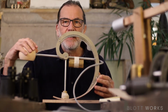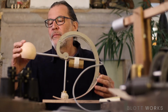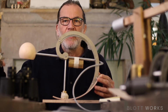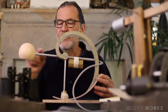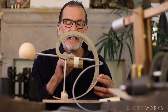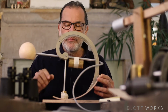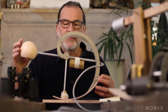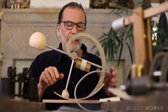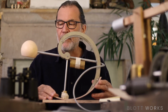This, of course, has to be of a certain weight, because it needs to have a bulb in it and a bulb holder. And it needs to be as far out as possible, because the whole point is to have an overhanging light over your desk area. So consequently, the length of that and the weight of that means that I need quite a weight on this end. So this has to be necessarily short, so that it's within the part of this lamp, but it has to counterbalance that. So that's another issue. We're going to play around with those weights, and this needs to be adjustable as well, ideally. So that's problem number 2.